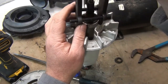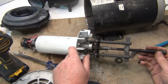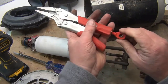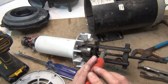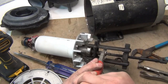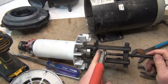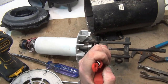For this I get smaller vice grips — hold it up as high as I can. Once the bearing is coming out, there's something to grab onto instead of trying to grab the shaft. There's a little bit of room because the threaded bolt is going to hit here, so I want to get it going so I can get a good grip on it.